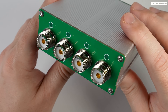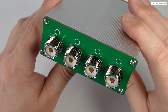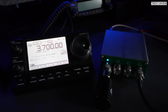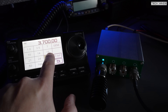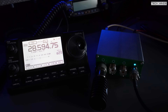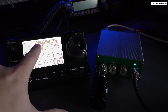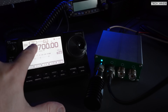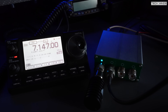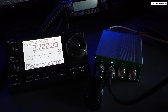If the antenna switch is in automatic mode, the input frequency will be sampled when RF is detected, and depending on the frequency it will change the antenna port automatically. For example, you could have the switch automatically set to port 1 when it detects a frequency of between 3.5 and 5 megahertz, port 2 if between 6 and 8 megahertz, port 3 if between 12 and 15 megahertz, or port 4 if between 20 and 30 megahertz.